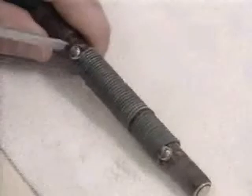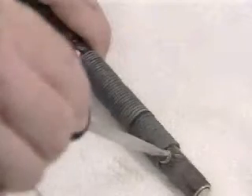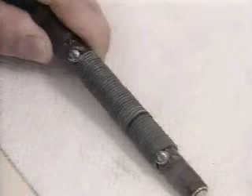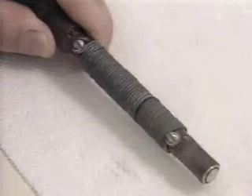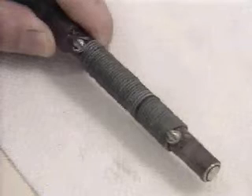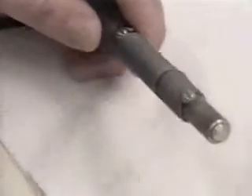Using a medium flat blade screwdriver, tighten the two screws that retain the lead anode to the probe body. These screws will loosen under normal use. It is important that these screws fit tightly, not only so that a good electrical connection is made, but also so that they will not interfere with the fit between the probe body and the canister.